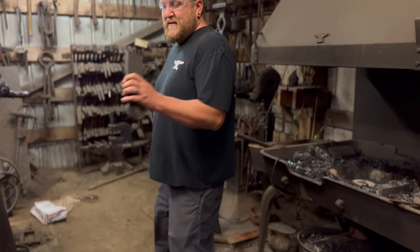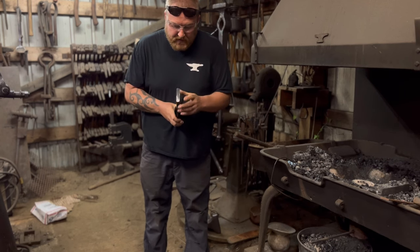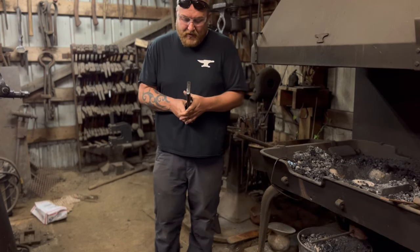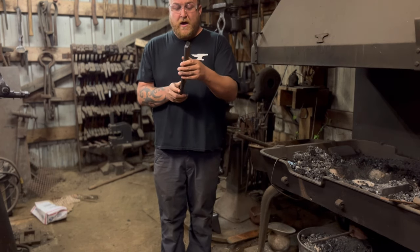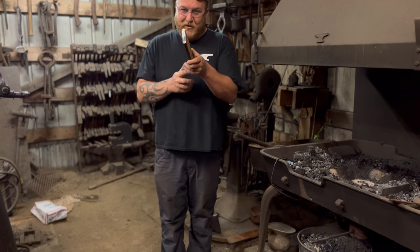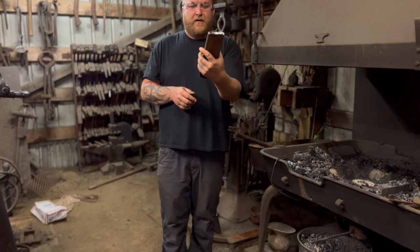Now this is probably a lot more spring than we need - it's pretty thick, about three-quarter inch on this side, but this side is relatively thin. We can always take some material off but it's really hard to add material, so this will be our spring that we're going to go ahead and forge up.